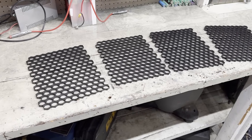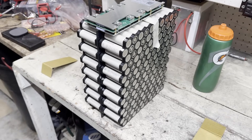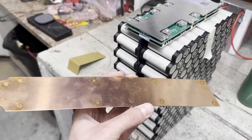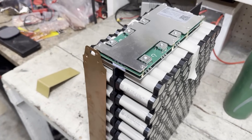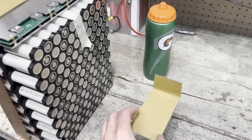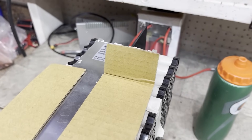To start building the battery, I first assembled all of the hexagon cell spacers. I then put the cells into the spacers and put the BMS on top to figure out what configuration would work best. I'm going to be using the same copper sheets I used earlier inside the battery. The main negative is going to be pretty easy — just one piece like that and then another one bent and bolted on. On the charge minus side, I have another piece bent so I can bolt all my cables up top.